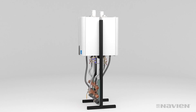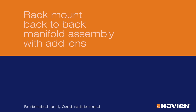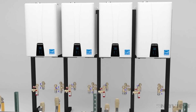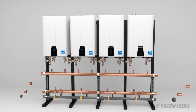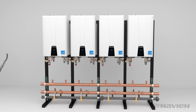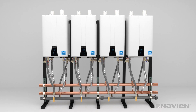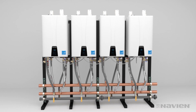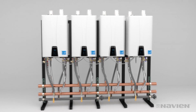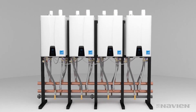Here's everything you need for a fast, simple, compact, back-to-back installation. Mounting four or more units back-to-back requires add-on rack sections and add-on manifolds. Follow the same steps, installing add-on manifolds as needed and connecting them to the mains and capping the ends. You may want to install couplings and caps before you mount the manifolds. Attach water and gas lines and common vent collars as required. Always follow the instructions in the installation manual for proper setup and cascading of units upon startup. Here we see eight units mounted using the same basic process, saving many hours of installation time.